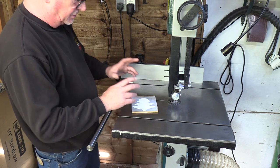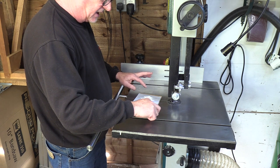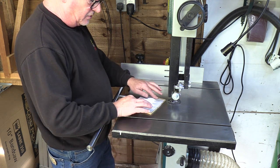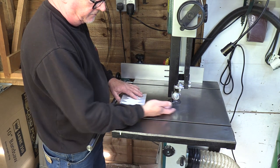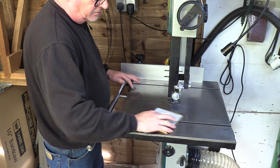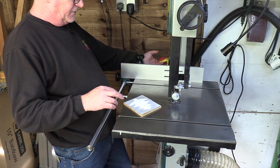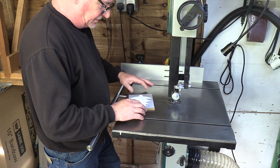It's not difficult, just keep your fingers with the pressure down. The bandsaw blade is cutting into the table, so it's not going to pull it out of my hands or anything else like that. It's just keeping your concentration and gently moving around. Now my table is all nice and clean, it's well prepared. I've put a wax on the table, a microcrystalline one, so I can move the objects around quite easily, and should be able to achieve the job. So we'll start off. Use the extractor.